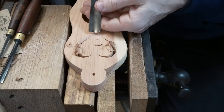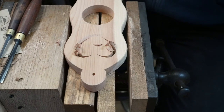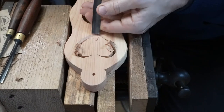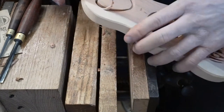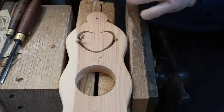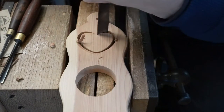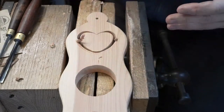You've always said you can get away with a lot when it comes to wood carving if you've got a nice piece of wood — it takes the pressure off the carver. Teak doesn't show those chisel marks as much. And we'll show it now how it's come up — when you put that shellac on, it comes up such a lovely colour. Having a nice piece of wood can hide the sins of the carver. It can really help us out. The juniper — I find it quite soft for carving, very different from carving a piece of teak.